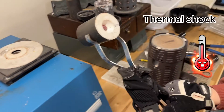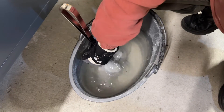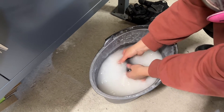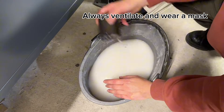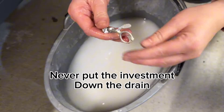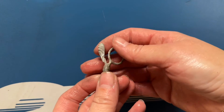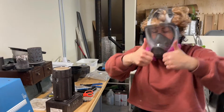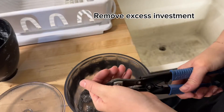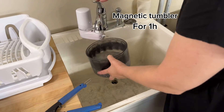You don't want to create oxidation on your piece, and you don't want to weaken the structure of your metal — it is a pretty intense thermal shock. Wait a few minutes, then quench by submerging the flask in one quick motion. It is now safe to clean your flask and fish for your casting. Here is a successful casting without air bubbles and a perfect flow. Oh, it's always so stressful! The next day I clean the excess investment with a brush and put the pieces in a magnetic tumbler for a clean finish.